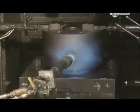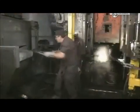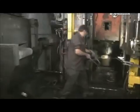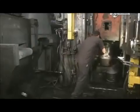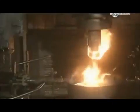The punch press and die are preheated to 426 degrees Celsius — the temperature required to forge the slugs. The slugs are brought to the same temperature in an oven. The punch then applies 2,000 tonnes of pressure to form the slug into the initial shape of the piston.